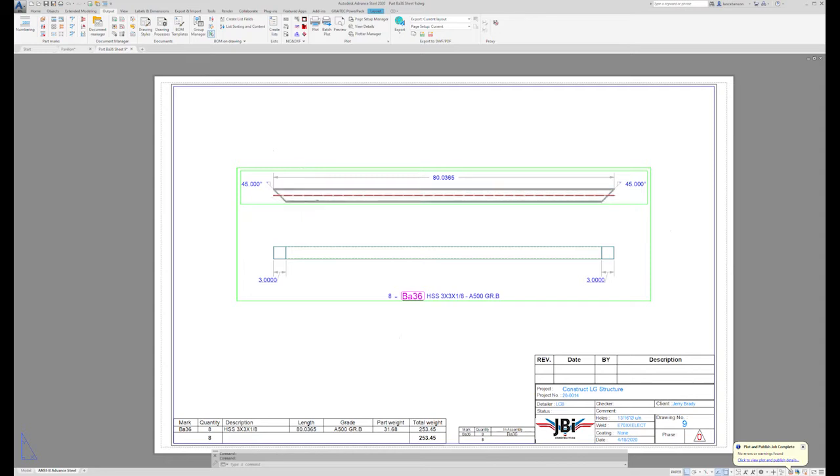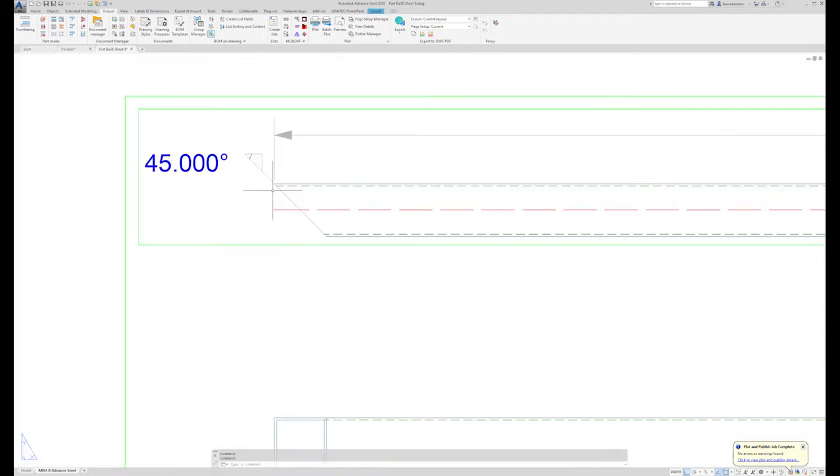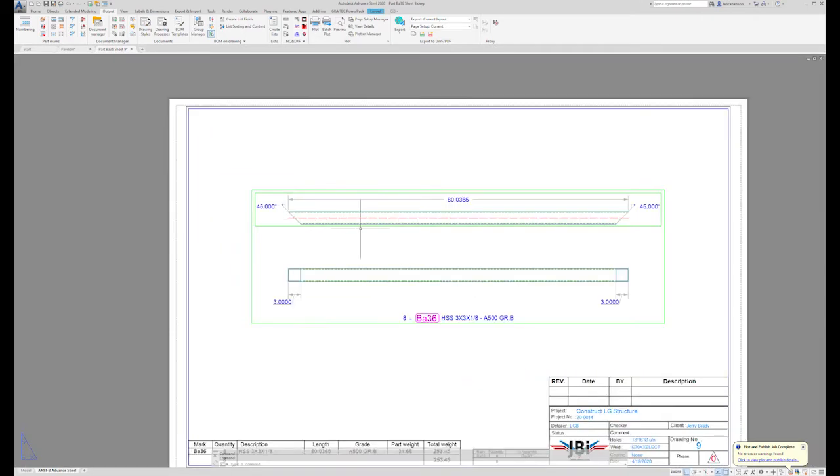And at that point, he's going to make sure the tube is up against the backstop of the saw, and he's going to push the part to where this tip just fairly engages the blade of the saw. And he's going to shut his vices. He's going to type in the shuttling dimension, and he's going to let the saw start, shuttle, and cut again, and then that's going to create this part.